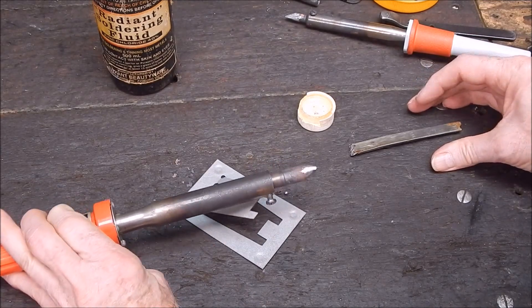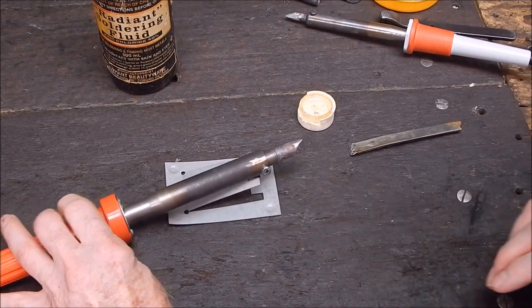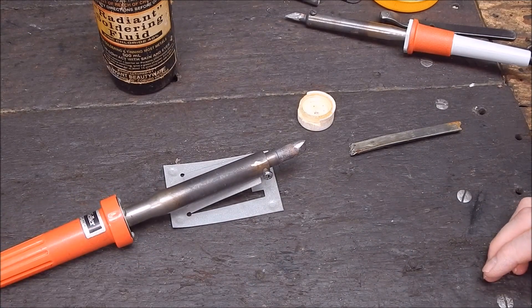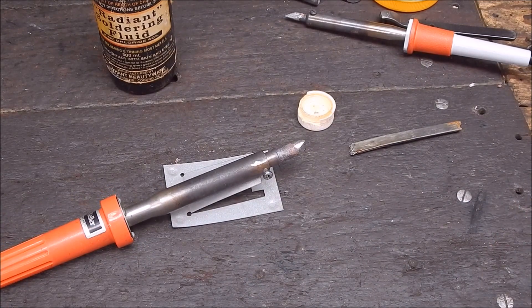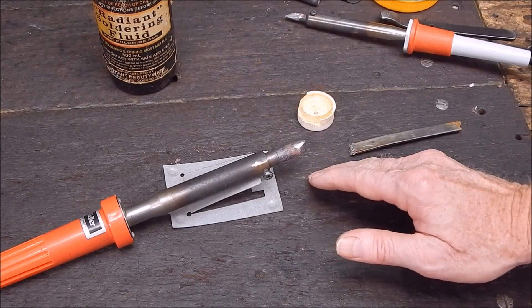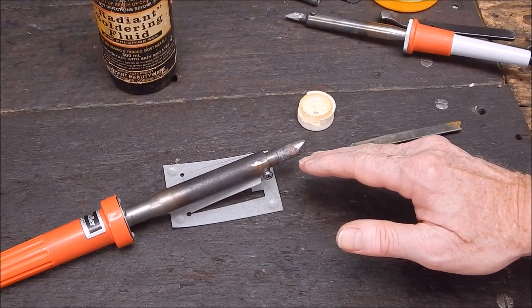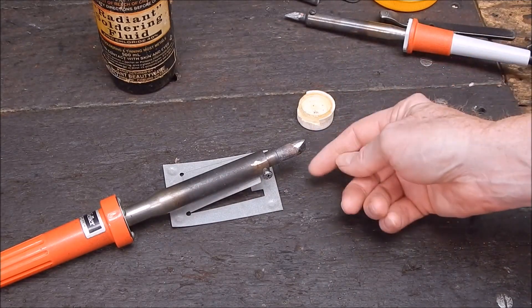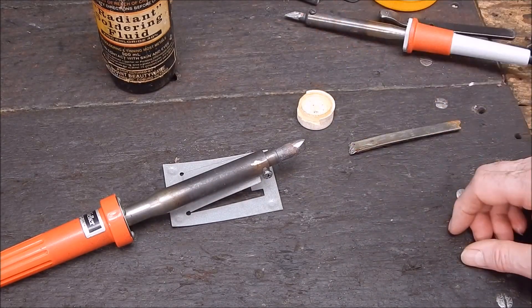It's as simple as that. That's all there is to it — just a couple of little tricks that will help you out and let you do a good job. It's purely bad preparation, the wrong preparation, and too high a temperature when people try and do the tinning. Just let it come up, test it all the way, and then job done.